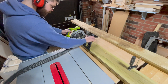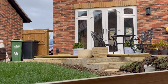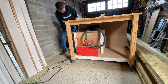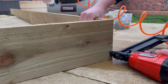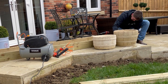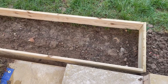All the side pieces of the planters were cut down using the circular saw as they're too big to use the crosscut sled on the table saw and I don't have a mitre saw. Once everything was built, I could carry all the longer pieces out into the garden to be assembled there, as they're just too long and would be too heavy to assemble in the garage. With the wood cut to length and all in the garden, I could rinse and repeat the same process as the first planter: pin it all together, pre-drill a hole, and then drive in some screws. It's worth noting that for each planter, even though I had pre-made plans, I ended up measuring the gap each time and built the planter exactly to that measurement.